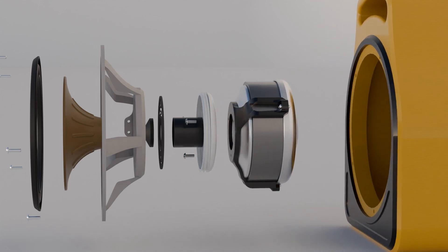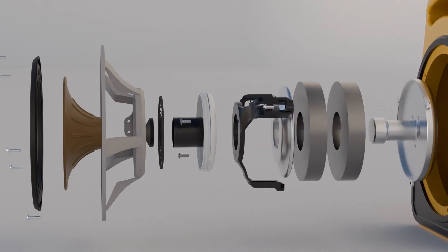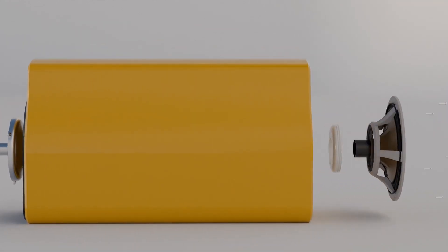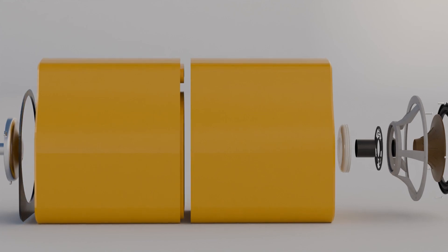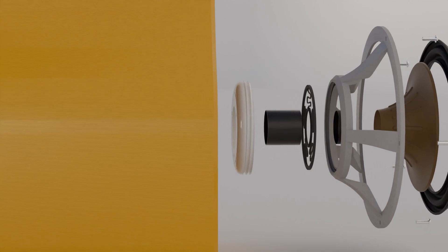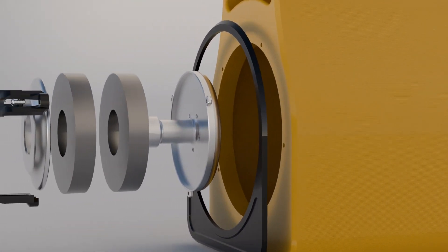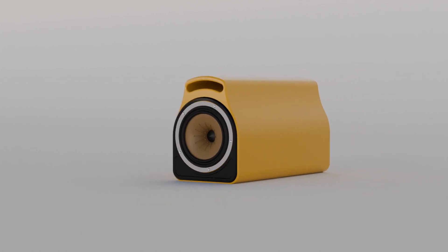The motor of the driver is still the same motor from versions 18 and 17, based around two ceramic magnets. The passive radiator is an exact replica of the upper section of the driver — it only needed suspension and no driving components, so it uses the same cone, suspension, and frame. The box is printed in two pieces and uses a tongue and groove assembly method of alignment. The front beauty bezel signifies that it's the driver side of the speaker.